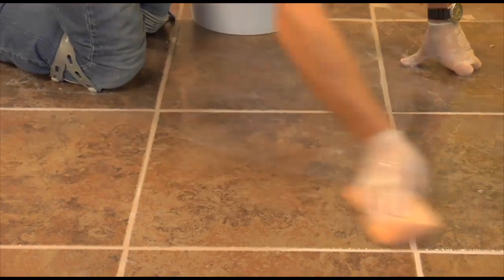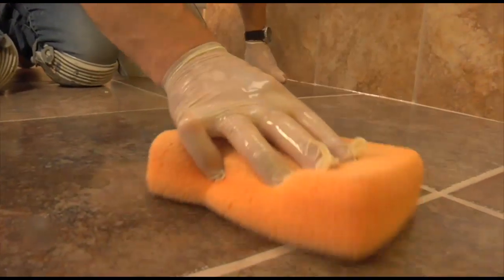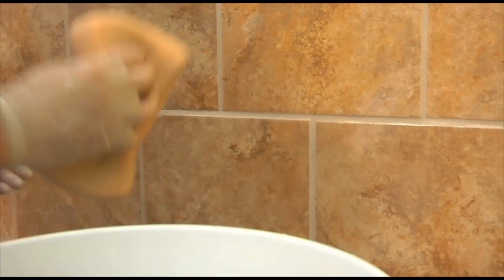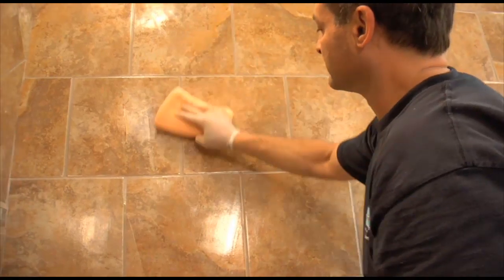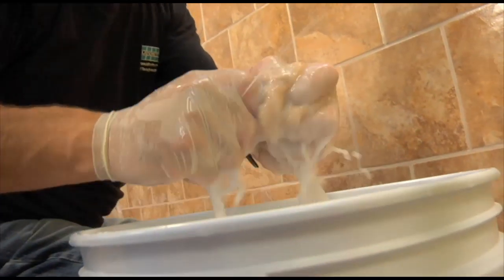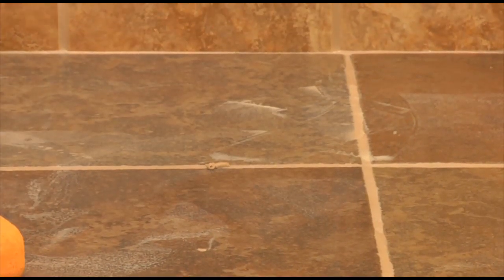Drag the clean sponge diagonally over the scrubbed surfaces to remove grout residue. Change water with cleaning additive mixture every 50 square feet, 4.7 square meters, when using multiple units. Rinse the sponge after every pass. Use each side of the sponge only once between rinsing. Discard sponges when they become gummy with residue. Always check work as you progress. Repair any low spots with additional grout at this time.